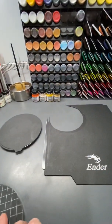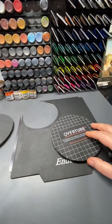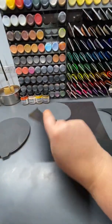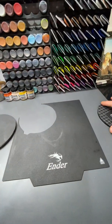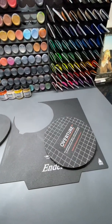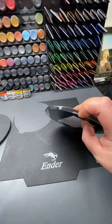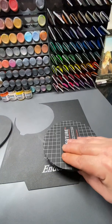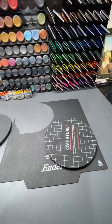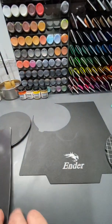Take your Alta build plate and place it on one sheet — you can do the magnet part or the build surface part first, it doesn't matter. Place your Alta build plate on there, draw your line, or carefully cut it with an X-Acto knife. Just be careful not to nick or gouge your acrylic build plate. I suggest drawing a line first and then cutting with good scissors, or if you're steady, cut with your X-Acto or craft knife. Then do the same with the other sheet.